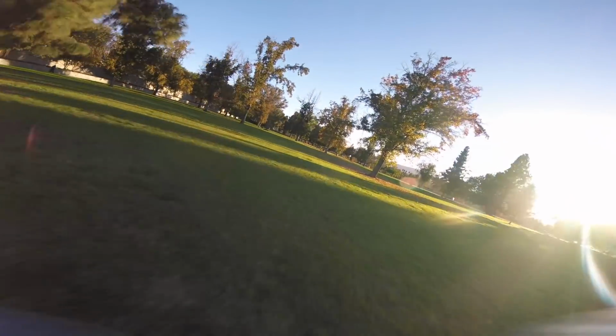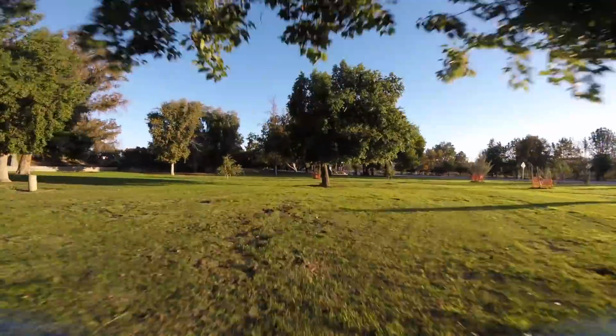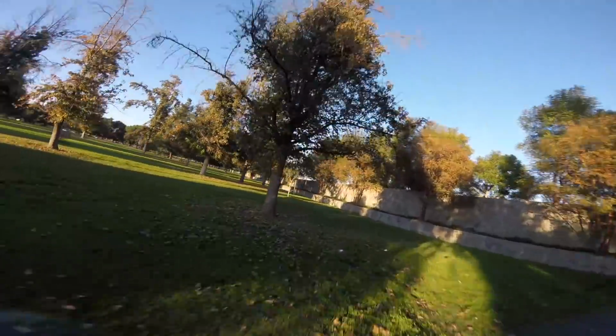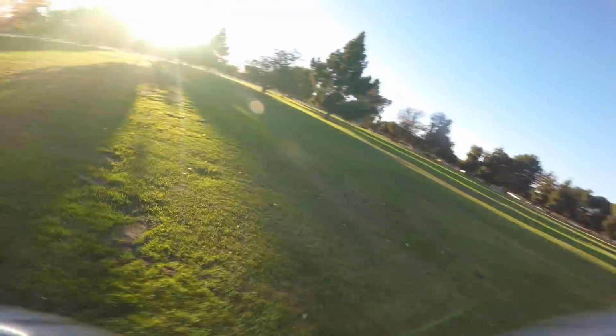Basically, top mounts hold their pitch and their altitude very, very well. You need minimal adjustment to keep it nice and smooth. There's no bobbing or pitch compensation needed compared to flying a bottom mount, say. You get a very locked in feel, which makes it much easier to get smooth, stable, and predictable footage because they track so well, which is perfect for the freestyle video aesthetic.